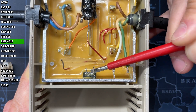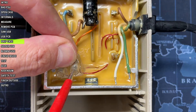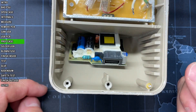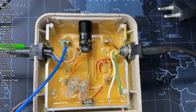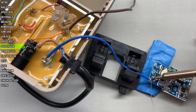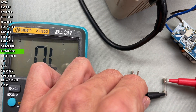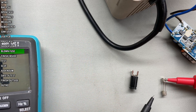First, cut the regulator's legs. I could cut these two AC wires as well but I don't want to — I'll just isolate them. This space here is where the new PCB will reside. The charger has to be plugged directly into the mains power, so I'll use these two wires to power it and solder them onto the PCB. I didn't catch this part on camera but I have a blown fuse right here — this is the original 160 milliamps fuse from the C64 power supply. It blew while testing.